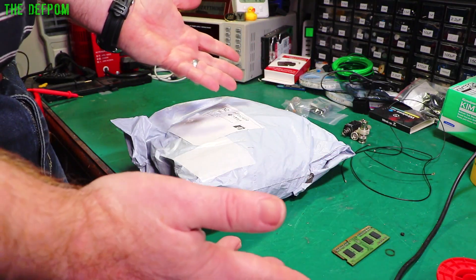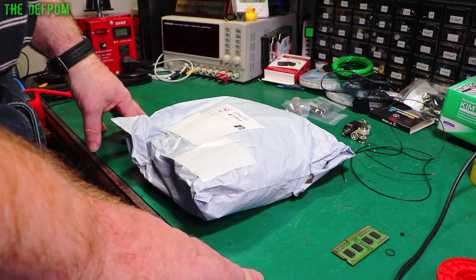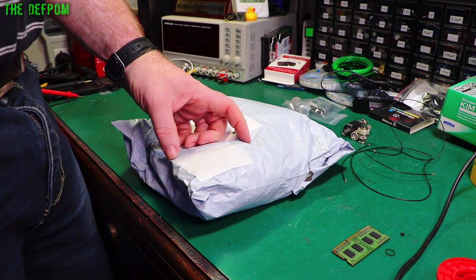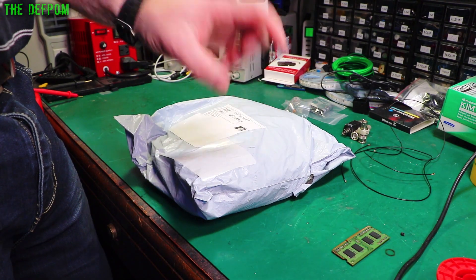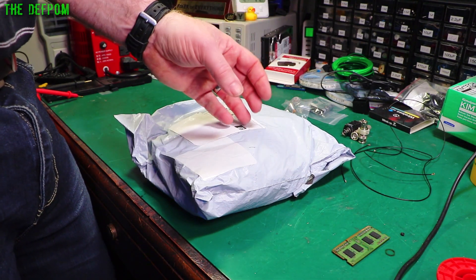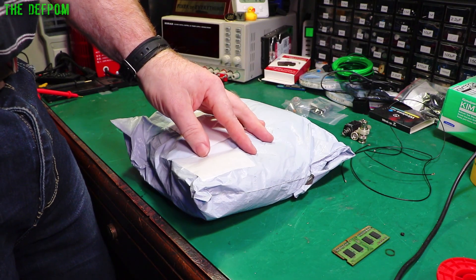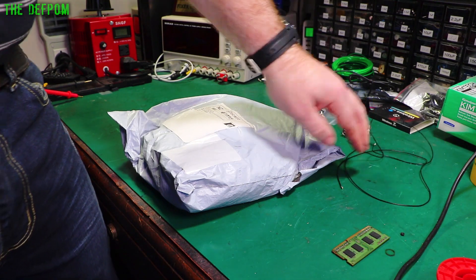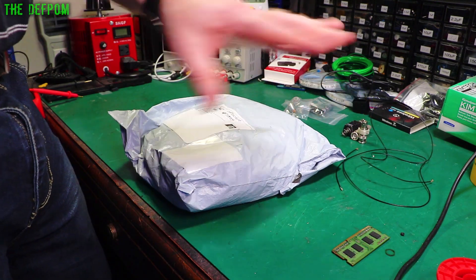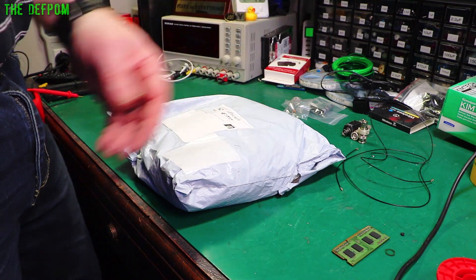So as I was saying, my 2010 Mac Pro needs upgrading for Bluetooth 4. There's a little plug-in module you can get which has built-in Bluetooth and WiFi on the same module, and you can plug that into the mini PCI slot. You have to plug a USB connection into it internally, link it through with some jumpers, and extend the Bluetooth wires. It's a bit of messing around but it's documented online and should in theory work. I'll be doing a video on that when I do it.